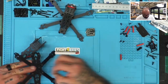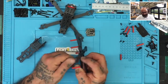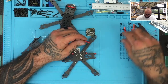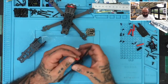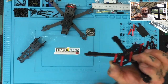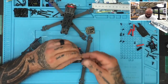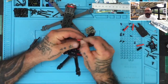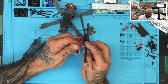In some cases you won't have to worry about sanding it — I'd say maybe a one-in-five chance you might. Just have a nail file there and be careful. I don't want to splinter the carbon fiber. Sometimes the cuts are really close because carbon fiber is laid in very thin sheets with resin, then cured. Sometimes one sheet can be a tenth of a millimeter, so they could be one sheet off or a little thick. Just have patience with that — nonetheless, it's in here now and this is going well.